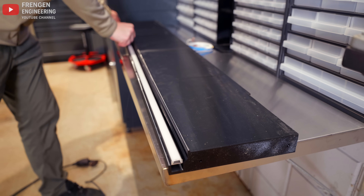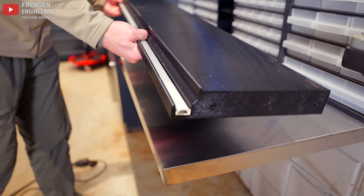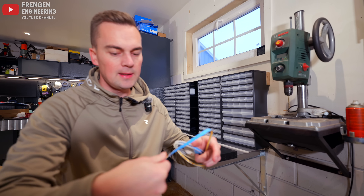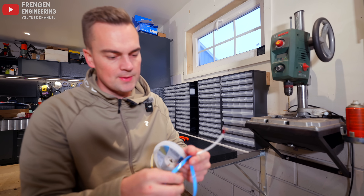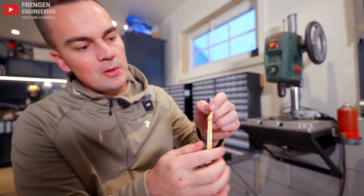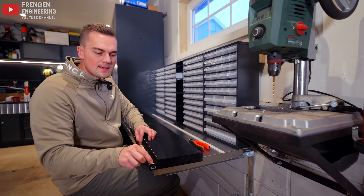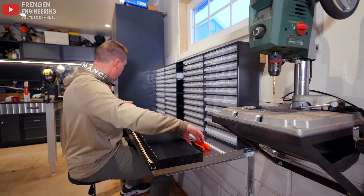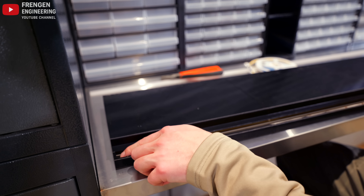As a little bonus the aluminium profile will actually strengthen the whole plastic part, working more like a rebar. This LED strip came with a wire that's too short, so I'll have to solder on some new wires. There are cut points every five centimeters — that's also where you can solder on new wires. I want the LEDs as close to the edge as possible on both sides so there are no dark spots.